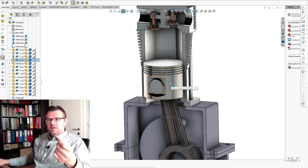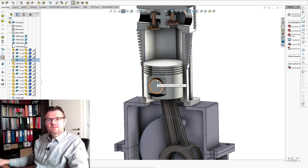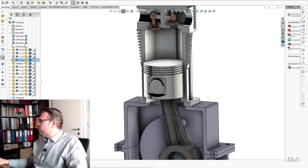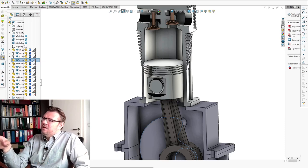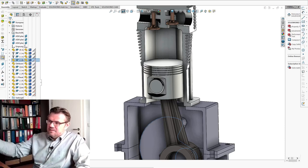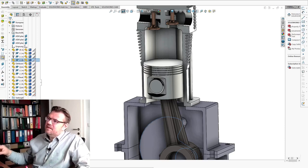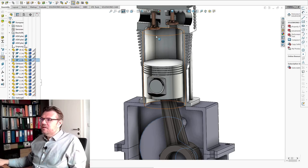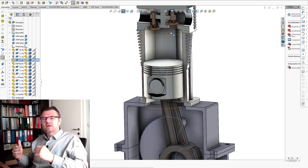You also see this is one type of compressor where we have to get the air inside here to the other side. We have to move it. So the maximum pressure on piston compressors is usually around 6 bars. If you have 2-stage compressors, so one stage after the other, we can reach up to 10 bars, 15 bars also. Quite high pressures. In the worst case, if there's the maximum pressure, we will simply compress the air until the maximum pressure, and then expand it. Or if this valve is never opening, we will simply compress the air.